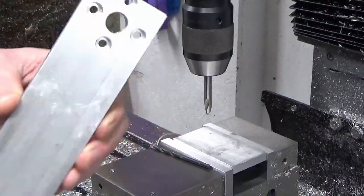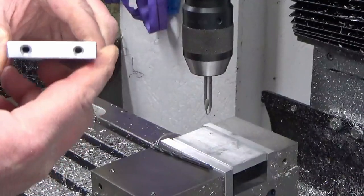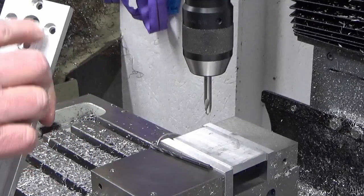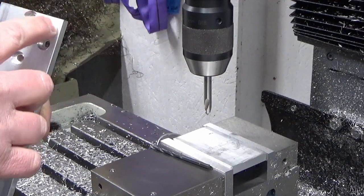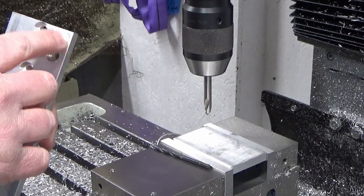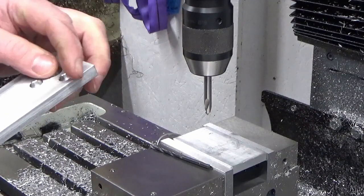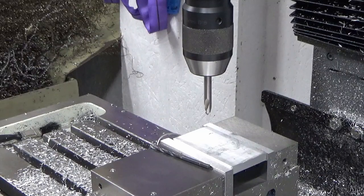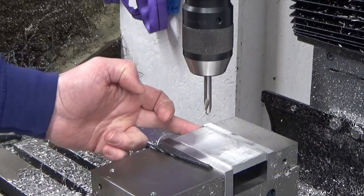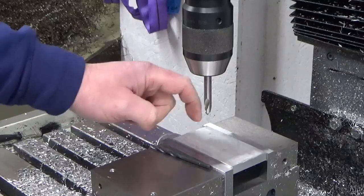That bit's complete — we've got four holes drilled and counterbored for M5, a central hole, and two holes drilled and tapped in that end. I've got a bit of machining to do — I'll have to take this corner off, but what I'm going to do is fit that to the round boss first, scribe that, and then probably hacksaw that to take that corner off. Anyway, that bit's complete. Moving on — I've got the next bit up in the vice, I've put my edge finder in, touched on this edge, touched on the back face, and I'm sat over my first hole position, so we'll start popping holes into this plate now.